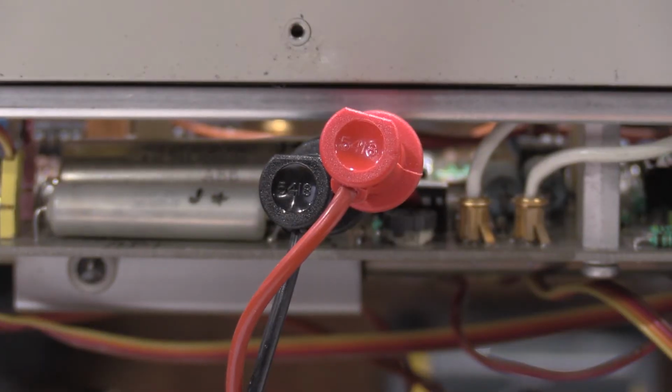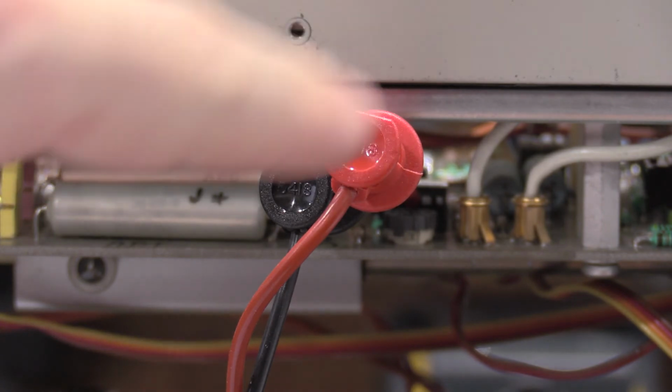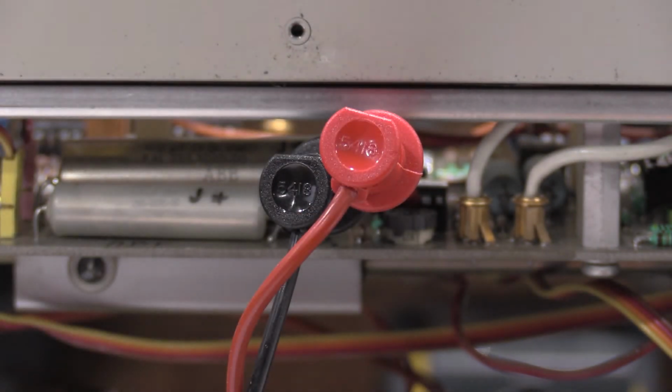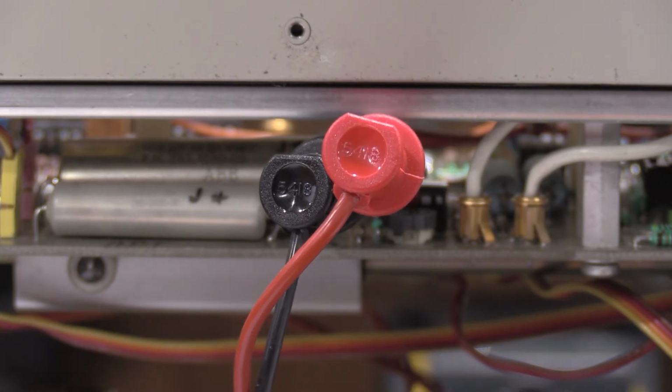Okay, for the multi-C adjustment, I got it the best I could. You hook the meter leads up to the op amps that are hiding back in there. I'll show you guys what that looks like here in a second. And you're looking for 0.0000 volts on the digital multimeter. And I got it the best I could. I even twisted the meter leads together. I'm in a really noisy environment, and we're into the reading of the hundreds of microvolts.